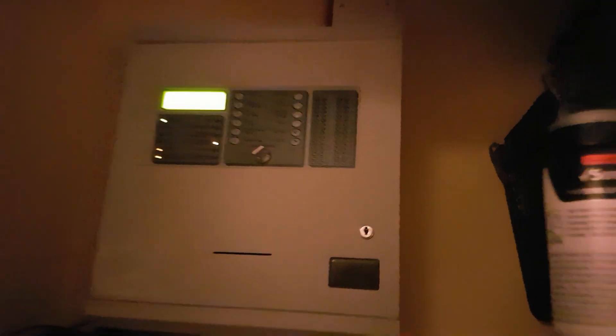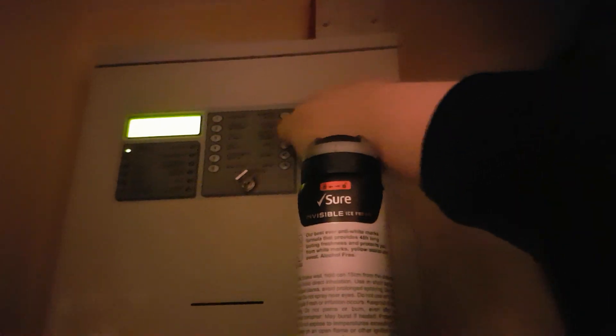Here's what you need to program the panel on the PC: a USB-to-serial adapter and a serial null modem cable. The PC software is mainly used for programming names for devices, which isn't critical but is useful. I've got two 12-volt batteries in it — one 7 amp-hour and one 2.8 amp-hour. If I turn the switch off on the fuse spur unit, you can see it stays on and shows a power fault.